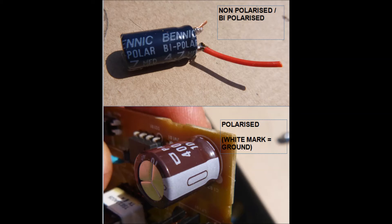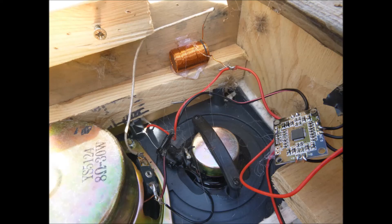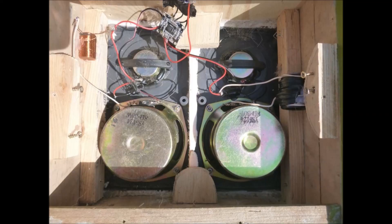The reason it's called low pass is because it lets the low frequencies pass — you don't want high frequencies going into your big bass cones, so you use a coiled inductor like the one shown here, which is a proper one out of a speaker. It's the copper coloured thing in the top of the picture. It's like a solid cast iron core wrapped with lots and lots of enameled copper wire, and you can see them both there.